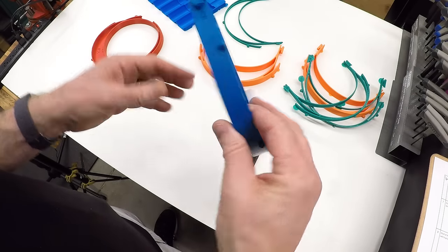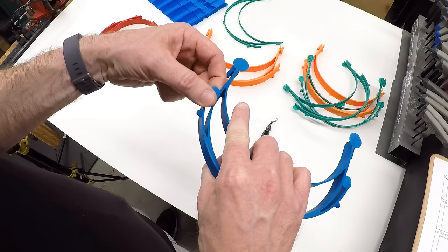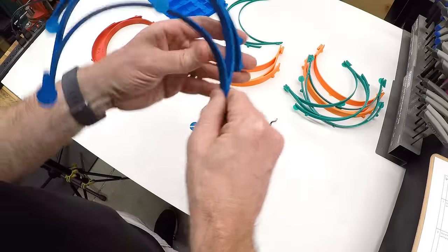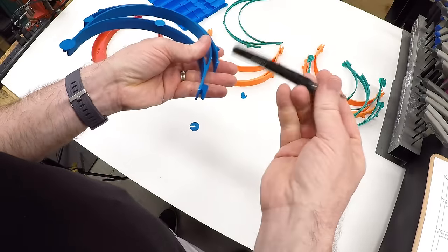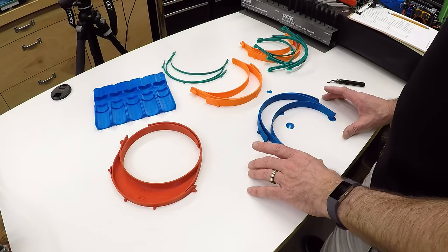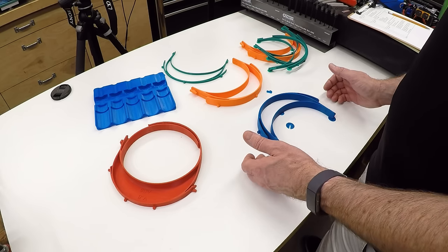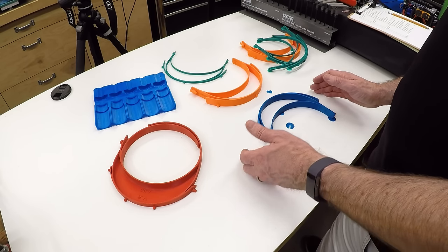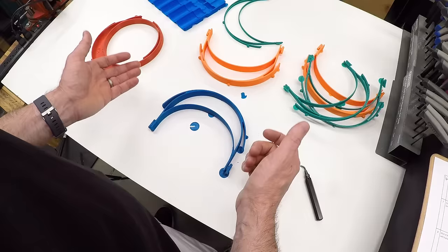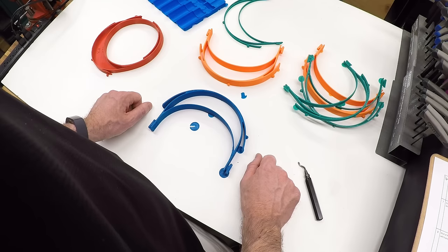And there you have it. In this case, to squeeze these onto the bed, I had one pad cross over two different parts, making it a little bit harder to snap out — but you can still generally just grab it, bend back and forth, especially with ABS, and it just snaps right off. Come back and clean up those edges with a deburring tool and your part's good to go. The most important thing to take away from this is that you're unlikely to find that one weird trick that solves all of your ABS printing woes. It really is about the system and every detail matters. But with some attention to detail, making trade-offs and small tweaks, you can be very successful printing with the material that many people find problematic. That's it for today — if you are enjoying these videos, please give me a thumbs up, feel free to subscribe to the channel and leave me a comment. I'd like to know what you think. Thank you for watching.